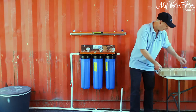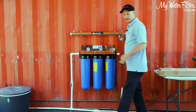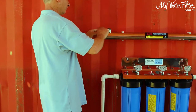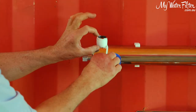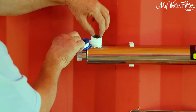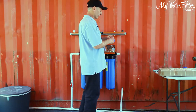So, first thing we're going to do is get some good old Australian plumber's thread tape and pull the caps off the inlet and outlet, and we're going to wrap about 8 wraps of thread tape around those threads, okay? You might think I'm doing a few more wraps, but it's quite a deep thread there. So I'm doing the 6 or 8 wraps over the complete surface. Start with about 6 wraps at the front, run down to about 8 wraps at the top. So there's a bit of a camber with the thread tape, and those fittings will lock on as they're connected on there, okay?